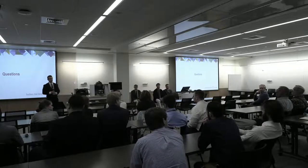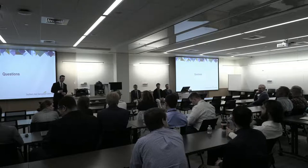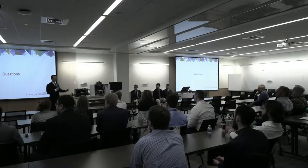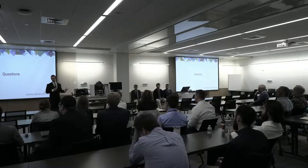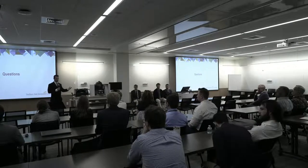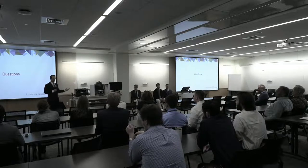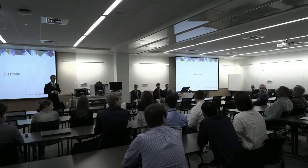Okay, thank you. My third question: you mentioned the backlight could be the biggest source of heat. Did you think of installing a ventilation fan or something like that? We did consider that idea. We accounted for the problem by cycling the backlight. We only have the backlight on for about the half a second it takes to capture an image. When we're actually moving the grid, we turn the backlight off. We were concerned with fans causing any sort of vibration while the grid is moving, more than we needed to. We were trying to avoid that if we could, and we found out that we could. That is an option we would have pursued had the backlight not been able to maintain its temperature.